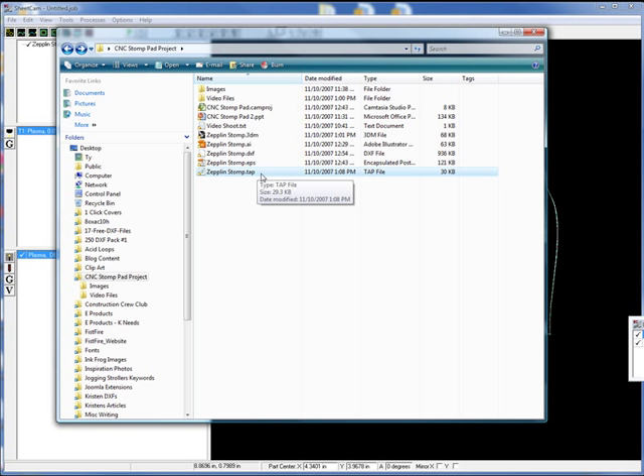And that's really what we need to bring out to our CNC machine — that's what it needs. It doesn't need any sort of CAM program; it really needs G-code to run off of. That's what control programs run off of. We just created it. Our next step is to go out there and cut it out of aluminum and see what it looks like.